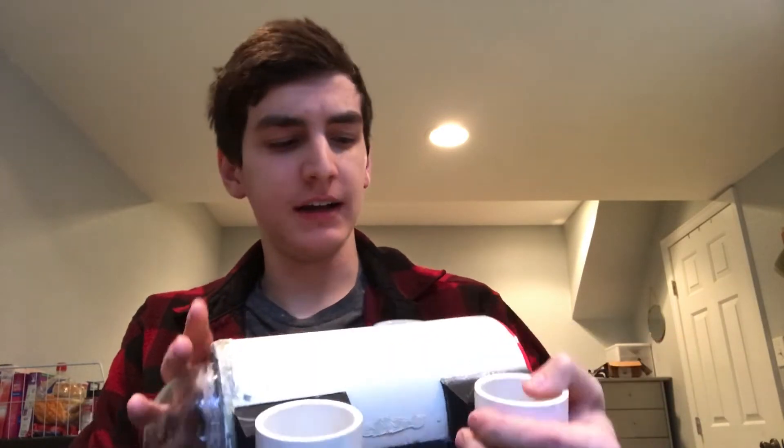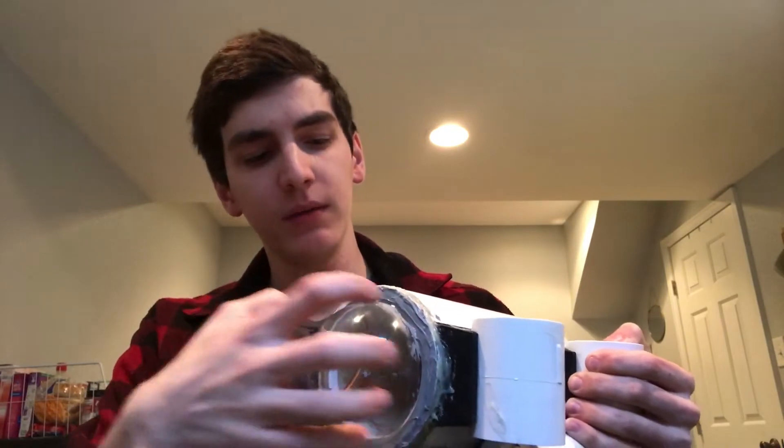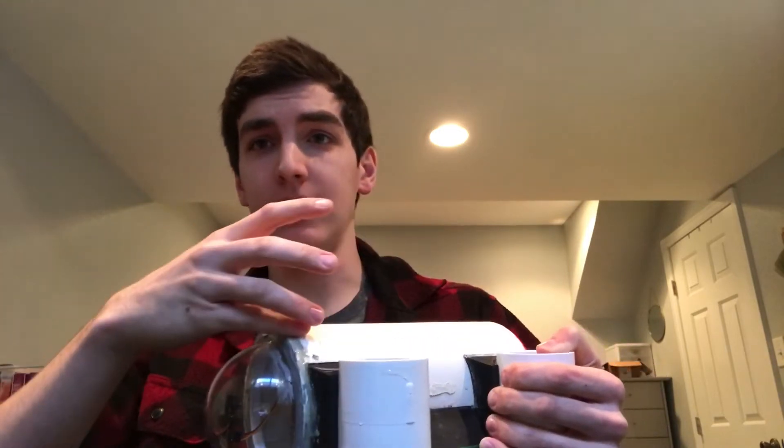An underwater ROV is basically a remote controlled underwater robot. It can do multiple things. This was our first design — it just consists of a main tube and an acrylic dome on the front. We messed this up the first time; we glued it on. We're going to be able to detach it this time so we can actually reach all the internal components. For the first design we did a PVC test plug thing — it leaked, so we're going to redo it.